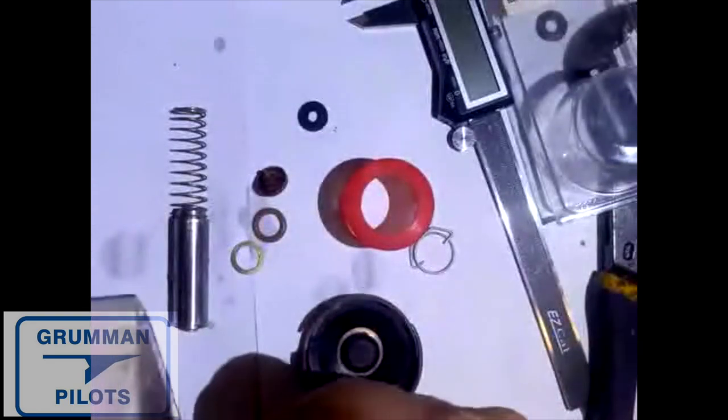Now, the thing about the fuel pumps that we have is they're not really rebuildable. We can replace the filter and the gasket and, of course, the safety wire and the connectors. But the plunger assembly and the contact point assembly is all sealed in metal, and therefore we can't get to it to replace it when they wear out. They just have to be chunked. Take the good bits off of it and hang on to it, but pretty much that pump is done. The new ones are the new electronic style, and that's what we're going to talk about here, and Fletcher has a procedure for those.